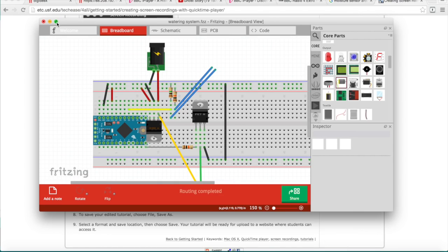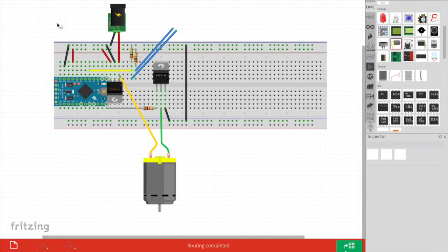So now I've calibrated the sensors, I'm going to think about how to connect the pump motor. The motor is connected to the Arduino via this N-channel MOSFET. This is basically an N-channel transistor which can switch very large loads. This pin here is called the gate. That's connected to the digital pin on the Arduino through a 10k resistor, just a current limiting resistor. So that's what turns the transistor on or off via the digital pin.